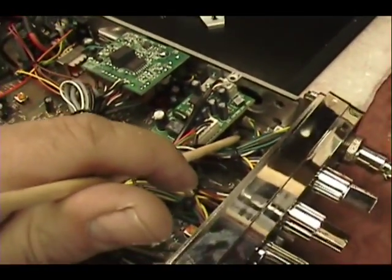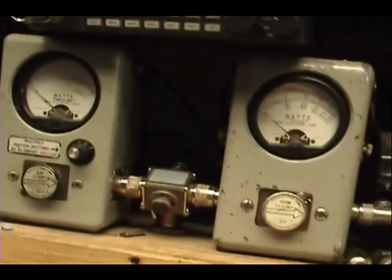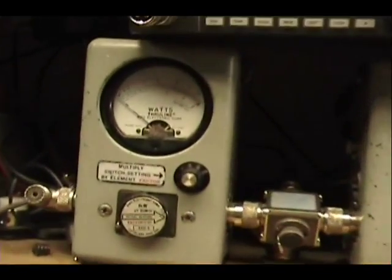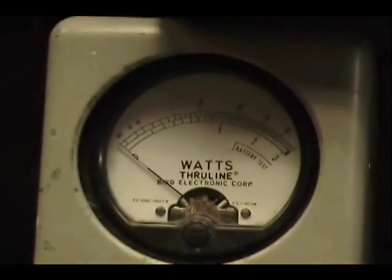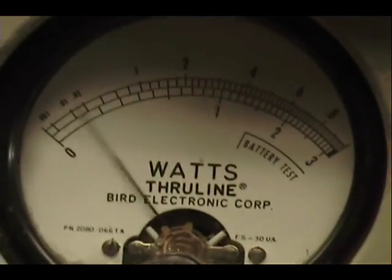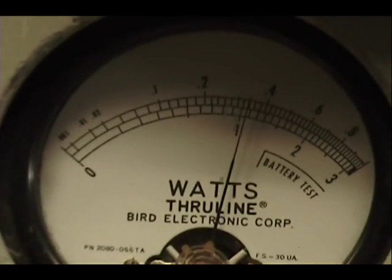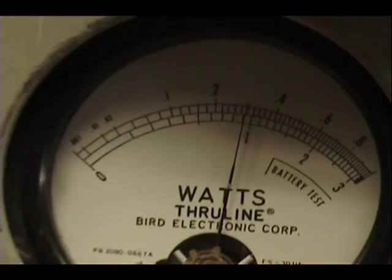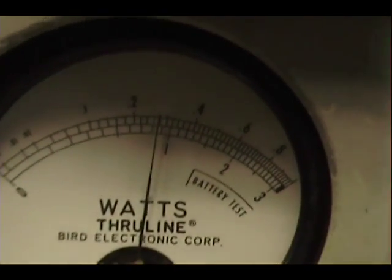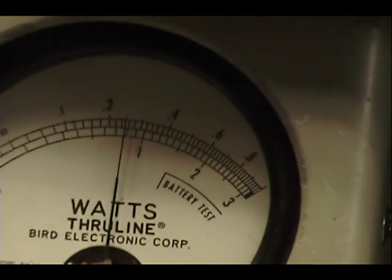Let's see where I am in the radio. And this is what it does — let's turn the radio on. I got it in low power. It does it in low or high power but it's more predominant in low power. If you watch, you're really dealing with it — you really notice it. You're starting with about four, drifting right away down to three and a half, down to three, down to two and a half.